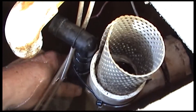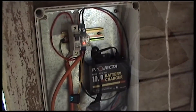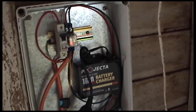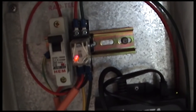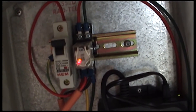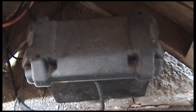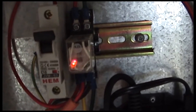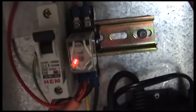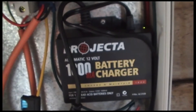In each tank I've actually got two 12 volt pumps as a backup system if the grid ever goes down. The system uses a 240 volt relay — when we have 240 volts the relay contacts are held open — and a battery charger keeping a battery in a float state. If we ever lose grid power, the relay contacts drop and connect, the 12 volt pumps kick in, and aerate the water to keep the fish alive. When the power comes back on, the relay disconnects the 12 volt pumps, the battery charger turns back on, and charges the battery back up.